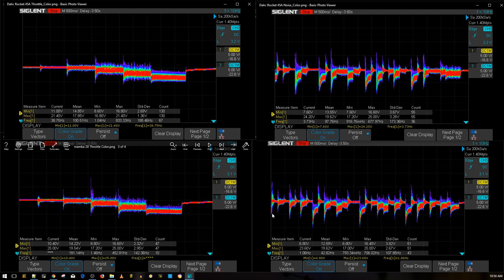This does not mean the Mamba is going to be a lot better at higher loads. The Mamba is still a pretty tiny board, but giving such a result is actually very good because this keeps the overall FETs in good shape and keeps the whole system — flight controller and everything — in better shape since you don't have nasty voltage spikes. It's being filtered very nicely, especially with the provided capacitor.